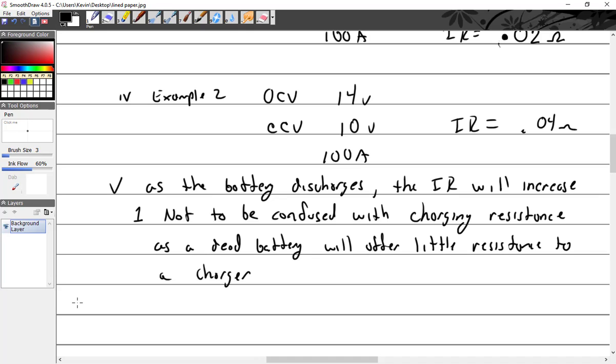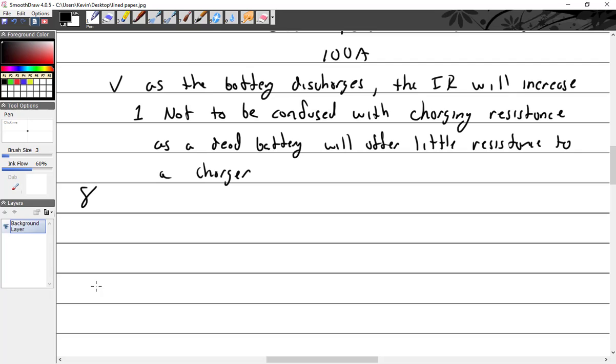So if I had a battery and I put it on a constant potential charger and I'm looking at it and it's taking 20 amps, and I come back after, well, I'm working on my aircraft, so I come back, I've had a couple beers, you come back, you're looking at it, and now it's only taking 0.1 amp. It's charged up. Yeah, and so are you, so don't work on your airplane. See how I tied that in? See what I did there? All right. Just need a couple like that, and you're good to go.